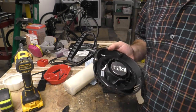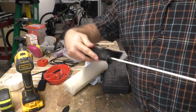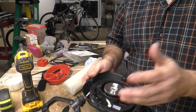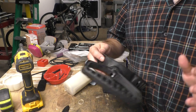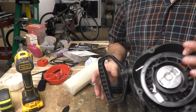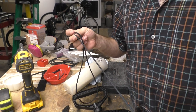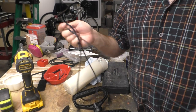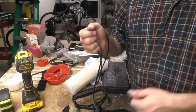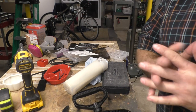The rope that it had after that last breakage just wasn't enough — when you have a short rope and you pull it too enthusiastically, that rope bottoms out and you can actually pull the knot out or damage this plastic pulley. That's why I'm changing it. Also, somebody could show up to help while we're on vacation and think this rope has a good five feet of travel when in reality it only has three — and they could break this pulley, which would cost even more to fix. So changing out the rope cost me $4 and about ten minutes of my time. It's also important: if your rope starts to fray even a little bit, just a little bit of fraying on it is all it takes to cause it to snap, especially on a cold engine at 20-degree temperatures.